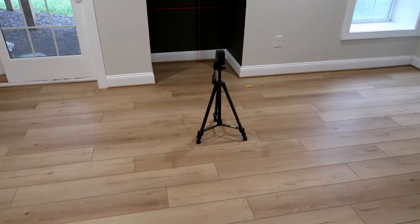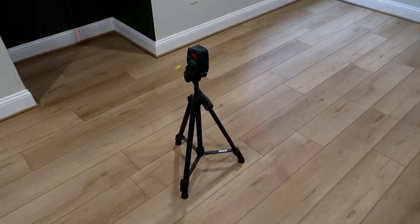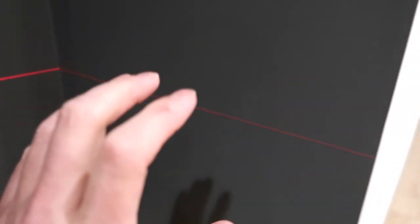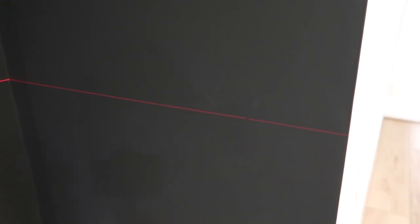Let's jump into the video and start building some shelves. I got everything set up now. I'm starting to work. Pretty much the second best tool that I have bought for this whole thing has been this laser and this stand. Set up your laser on your stand, get it pointed where you want, have it actually measured out. I've got a little tick mark on here. I've got the laser put right on that mark. So what I'm going to do now is draw the line across the top where this laser mark is all the way around — that is going to be where the floating shelf support is going to be nailed or screwed into the wall. Then from there I'm going to take my measurements between the shelves, put the laser line on those, and that way I'll have everything worked out exactly like it needs to be.